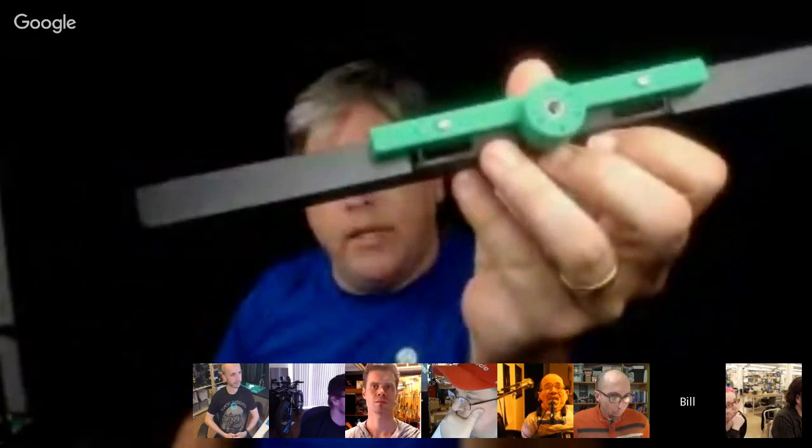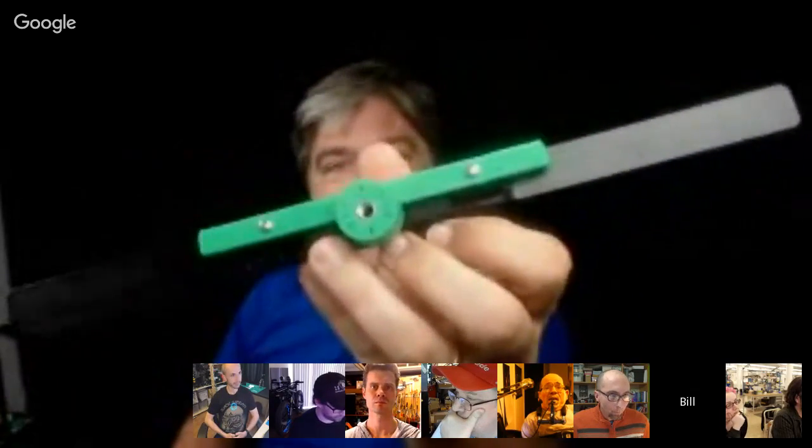So our approach was to make things that would take devices like this eye gaze device, with the strange little M3 screws, and we just went ahead and put in a 1/4-20. You can see there's a 1/4-20 socket now, so you can put it on any camera mount. You can go to Amazon and get any of the 3,500 camera mounts out there and screw it on. This one's $20. It's one of the articulating arms with a single screw that locks down.